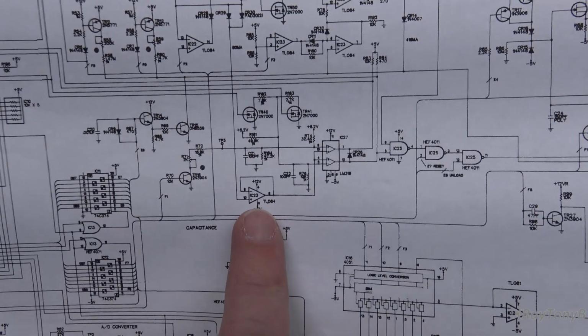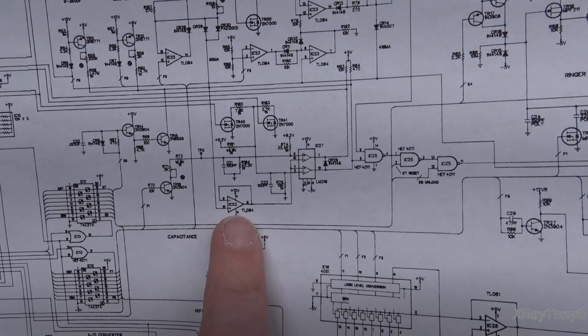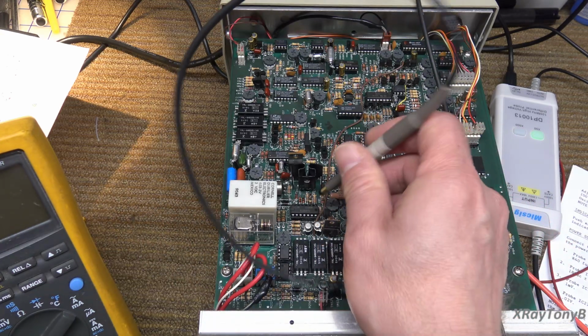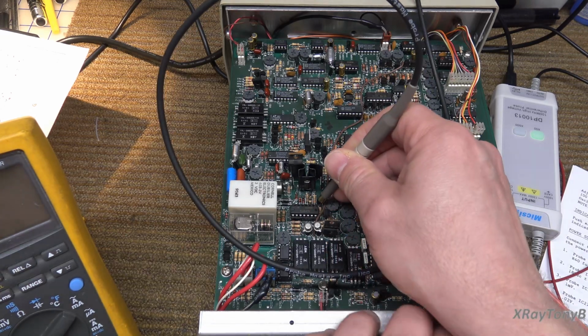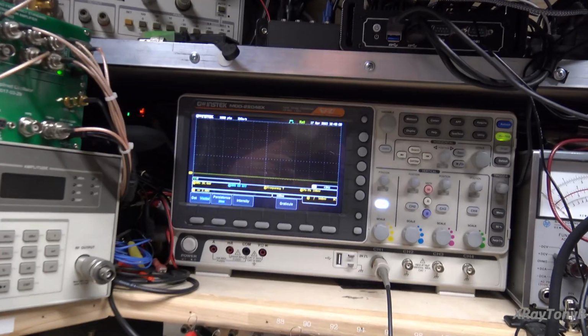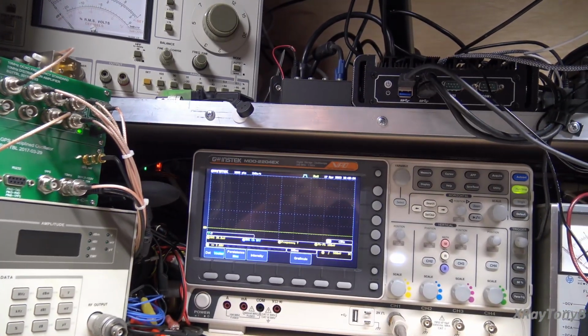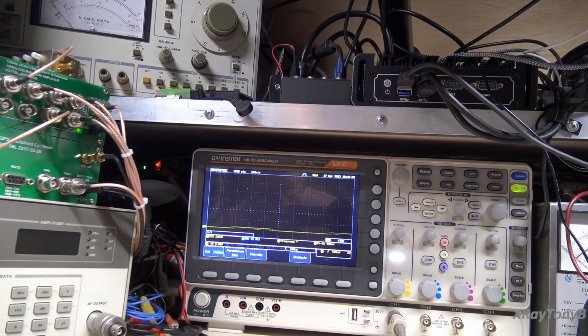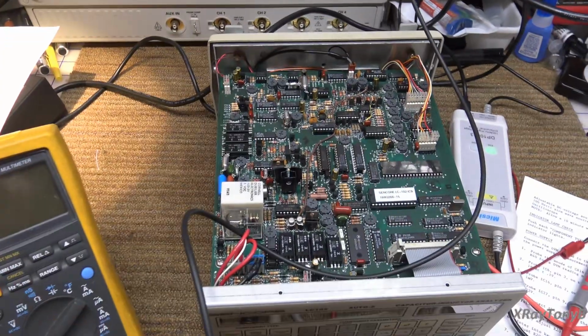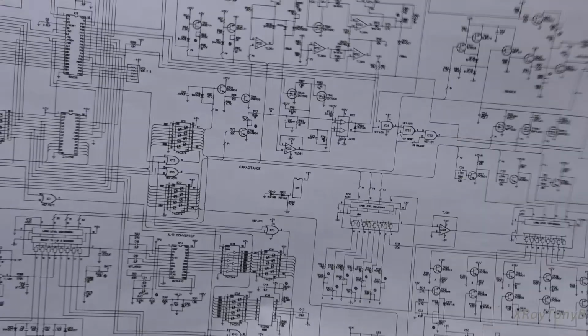So let's go back to, again, IC23 pin 8, if I'm reading that correctly. And I'm getting pulses on that. Why is that? So if I go up here, yes, they are very small pulses and they are negative going, but they are there. And of course, if I change the voltage scale, you'll see them more prominently, but bottom line is, if that is supposed to be tied, you look at the schematic, those are the same point. See, this was driving me crazy about this schematic.